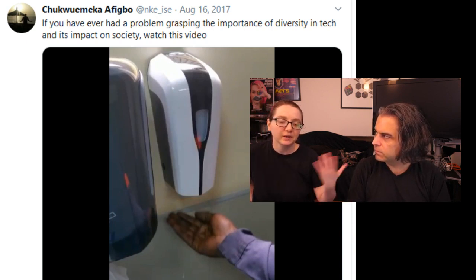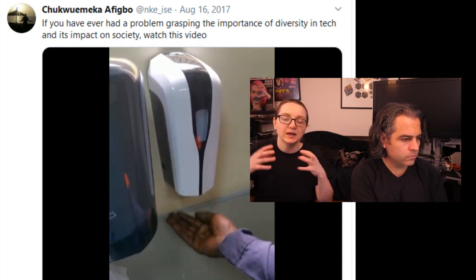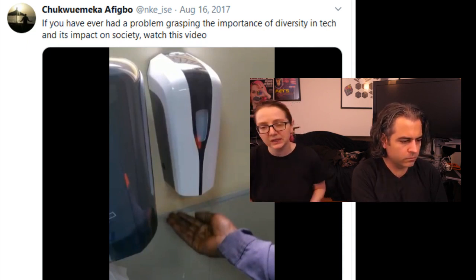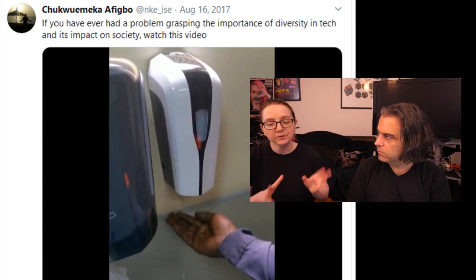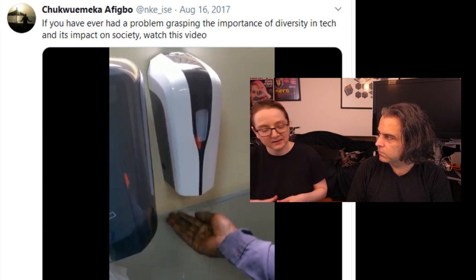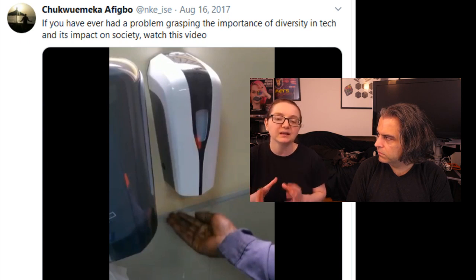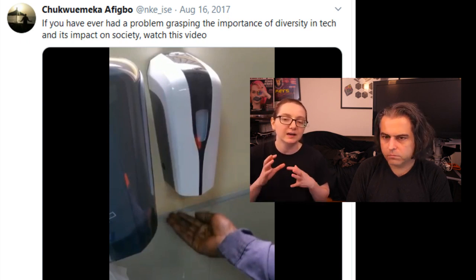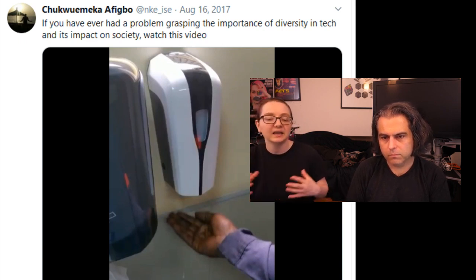And so another type of sensor that sometimes people use is ultrasonic, but ultrasonic also has some downsides in that you can't put something in front of it. It's very bulky. It's inexpensive, but also it can be affected by noise. So, infrared LED distance sensing is something that we use a lot, but there's definitely a lot of situations where you can get a bad user experience because the reflectivity or ambient light can affect your readings.